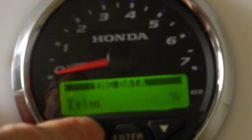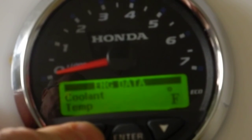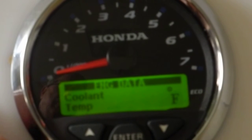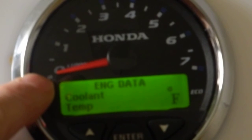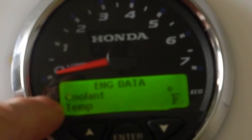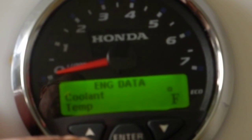All I need to do is toggle through until I find the data I want displayed on this screen. Options include engine hours, trim adjust, fuel tanks — fuel tank 3, 2, 1 because we set it for three tanks — fuel rate, and more. I want engine coolant temp. I've chosen that one, so I hit enter, the reverse screen goes away, and now every time I come to this screen, it's going to show coolant temp instead of engine speed.